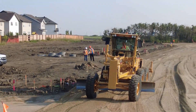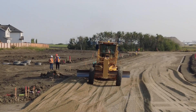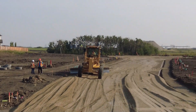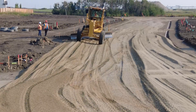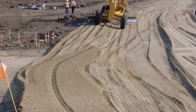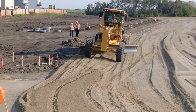We're looking for two percent on the top of those berms. That two percent actually feels a little weird to do because you're slanting the opposite direction of the quarter crown — you're two percent toward the road on the berm, and then when you get out on the street you're five percent toward the gutter. So it's a strange feeling to do these berms and add two percent on them when you're not used to it.